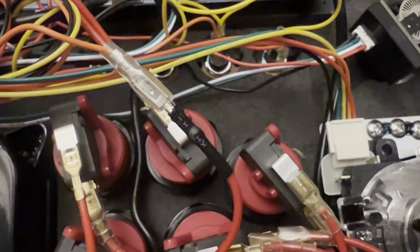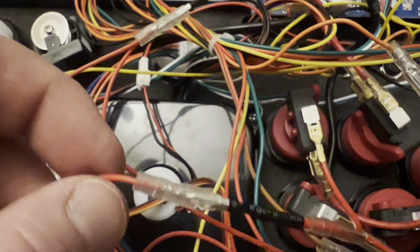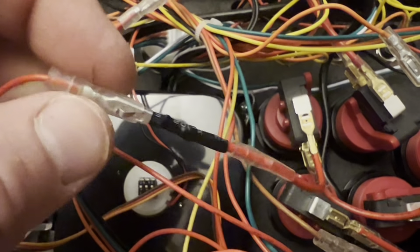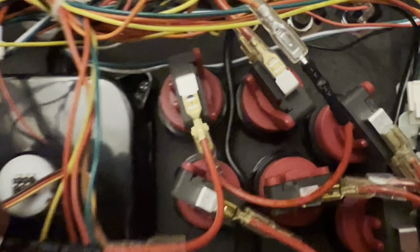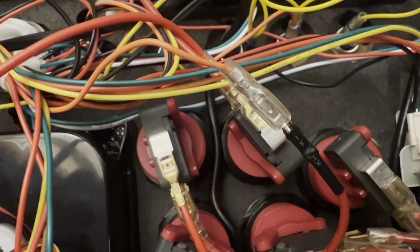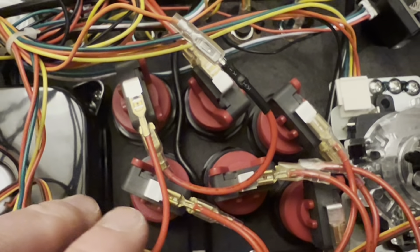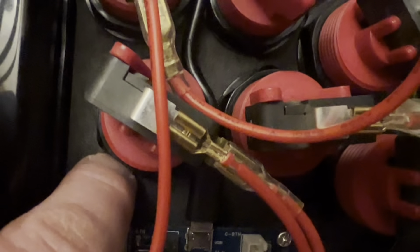So you say, how did I get that to work? Well, you could rewire the thing — snip the wire and then add another cap or add more wire. But instead I used this male connector that went into that female connector, a 0.110, and then it goes to a 0.187. So I had to get 24 of those wires because there's two on each button. Normally I would have these all facing the same way, but that was really hard to accomplish because once you get this nut screwed down, it's really hard to get off because there's this nice felt underneath, which makes it nearly impossible.